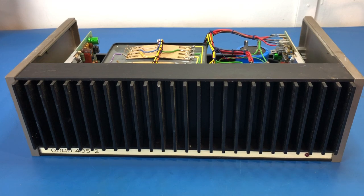I heard a humming sound in one channel. The humming started immediately when I got one of those 'you've got mail' sounds, and at the time I thought maybe my DAC or my laptop had gone funny. The humming came and didn't go away. I also had a speaker-save relay kit on the output of this unit — one of those from a previous video — and not too long after this started, the relay kicked out to disconnect the speakers. Then a little while later the relay kicked back in and I'd lost the channel altogether.